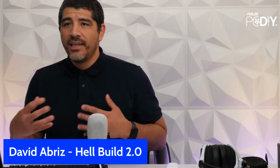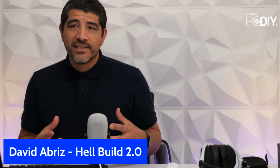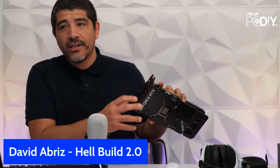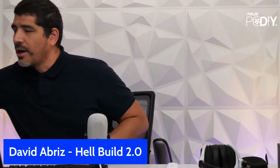Do keep in mind that there are a lot of factors that can sometimes influence cables, from EMI to pickup sensitivity depending on where they're layered or making connections with other items. Also even fitment; sometimes you can have oxidation on ports and connections. So with older items, you might want to get something like DeoxIT spray and use it on connectors. That can sometimes improve connection or dropout issues. Different little anomalies like that can happen.